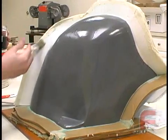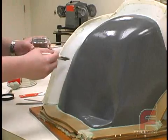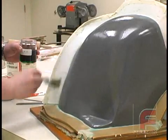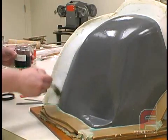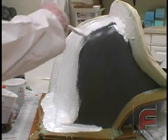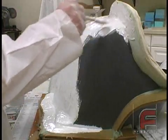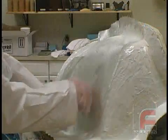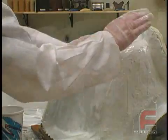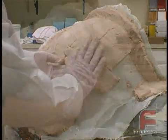Finally, we apply our two coats of wax release, two coats of PVA, and our last layer of wax release. Our wax release will also dissolve some of the excess clay that we hadn't removed earlier. The remainder of our paste laminating is exactly as we did the day before: applying two layers of surface coat, three layers of fiberglass cloth, our half-inch thick layer of paste laminate, and finally our last three layers of fiberglass cloth.